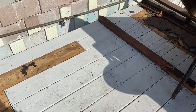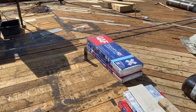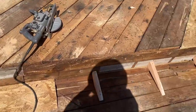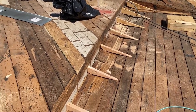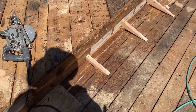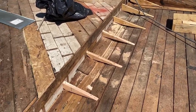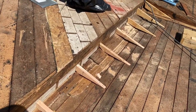This wall we're going to put back again on Monday. Right here I'm going to build the crickets because before they didn't have any slopes. I created a slope — I built my little frame right there. Remember: before you make any cricket, mark it on the roof and then follow the marks with your two-by-fours or two-by-sixes. That's the way I did it. Now I'm going to cut my plywood and put it in place.